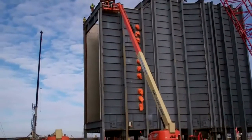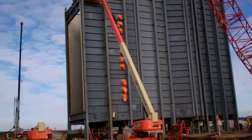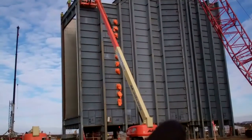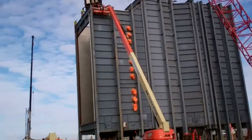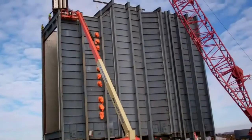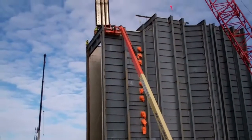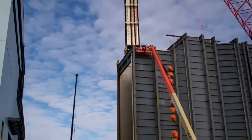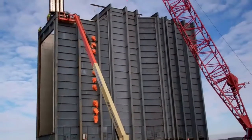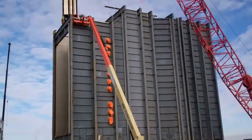Now the stainless steel liner plate that runs through this boiler actually stops — it's hard to see — but this expanded section right here contains the CO grid and the SCR grid, which is our NOx control. Beyond that, the cold end of this boiler is carbon steel plate. In the next few minutes we'll get an inside view of this boiler as the module is being set down into place, and we'll see the burners, the locking bars, and a bunch of other parts of the boiler that are different from the standard conventional coal-fired boilers in the rest of the cooperative.